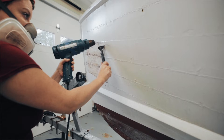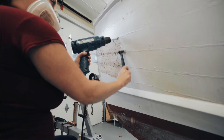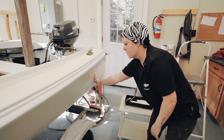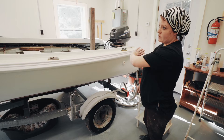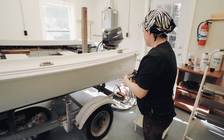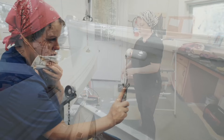There's a decent amount of paint buildup, so a good sharp scraper is the right tool for the job at hand. Because I'm right-handed, I'm going to be starting back here and moving to the left. If you're left-handed, you could start on the other side and move left to right. Moving right to left just helps keep my body out of the paint I'm working with, so I'm less likely to get it on me.